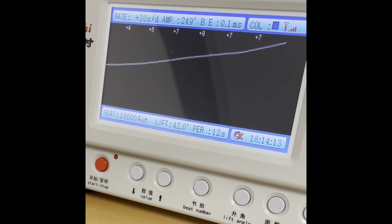It looked pretty nasty to start off with, but that was the hairspring being a bit out of center. I didn't take a picture of that or the process of repairing it, but that's been sorted now, so I'm happy with that. We adjusted to plus 12 seconds, dial down, and we turn it around to dial up. See what it does.